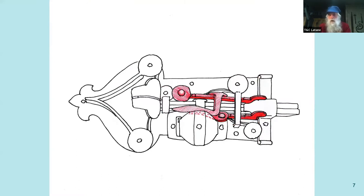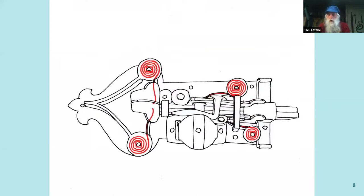The tumblers are highlighted. The one on top has an arm reaching into the ward box that's lifted by a key, and it pivots on the far left. The one on the bottom also has an arm reaching into the ward box, but because the key lifts things, the pivot is in the center — so when the key lifts the arm on the lower tumbler, the end retaining the bolt is lowered. When the key strikes both, the upper tumbler rises and the lower tumbler lowers, disengaging the lugs on the bolts.